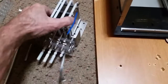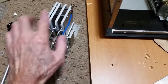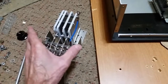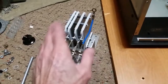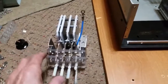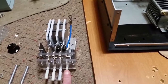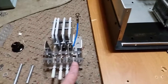Here we have a variable input capacitor bank. These four caps right here were fixed values, which I guess they worked — Nye Viking used them. But in today's world of radio, you need more control than just four different values available. You could combine two, but they didn't recommend it. Plus, this one was busted off — it was in there cockeyed, so it couldn't even engage the main part of the air cap. You couldn't even turn the air cap on.